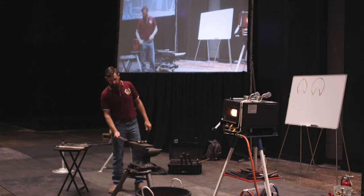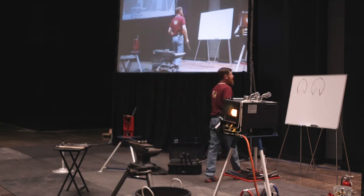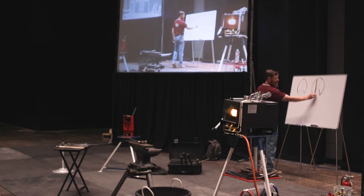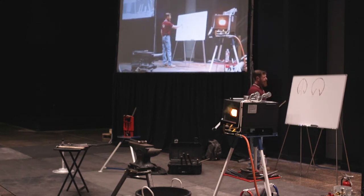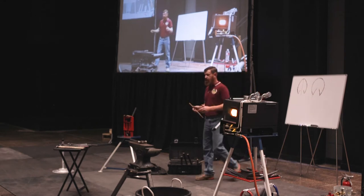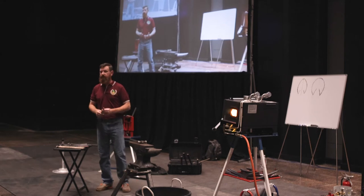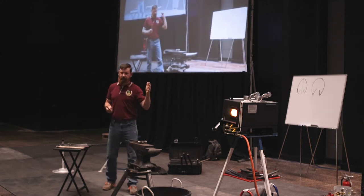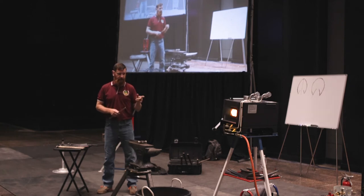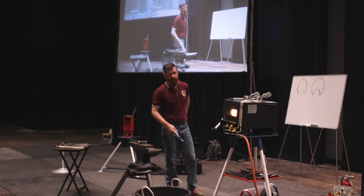Typically when we look at feet, one side's going to be inside a little bit more than the other, or pretty symmetrical, so when you break down the foot, it makes it really easy for you to see if one side comes further out than the other, or one gets tucked in further than the other. And when they do that, just say it to yourself. It's really easy to take it to the animal and fit the foot to it.